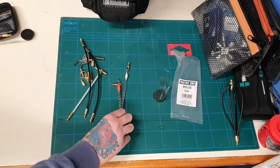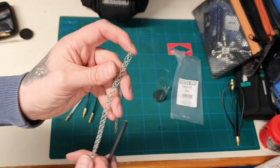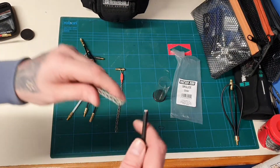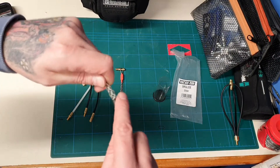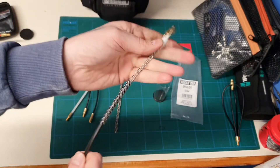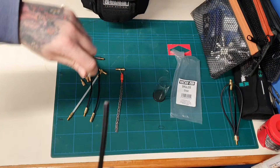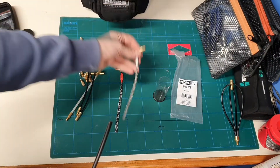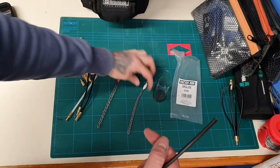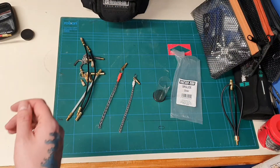Coming along to the ones I really like in particular — because we've all done it, using miles and miles of tape to attach a bit of cable on the end of the rods. These I'm going to really enjoy using. You just pop the sleeve over your cable and it gives you a really good firm grasp of the cable. Personally I think you're going to break the cable before this slips out, which is really good. This is the thicker version and this is just the data-cable size gauge version.